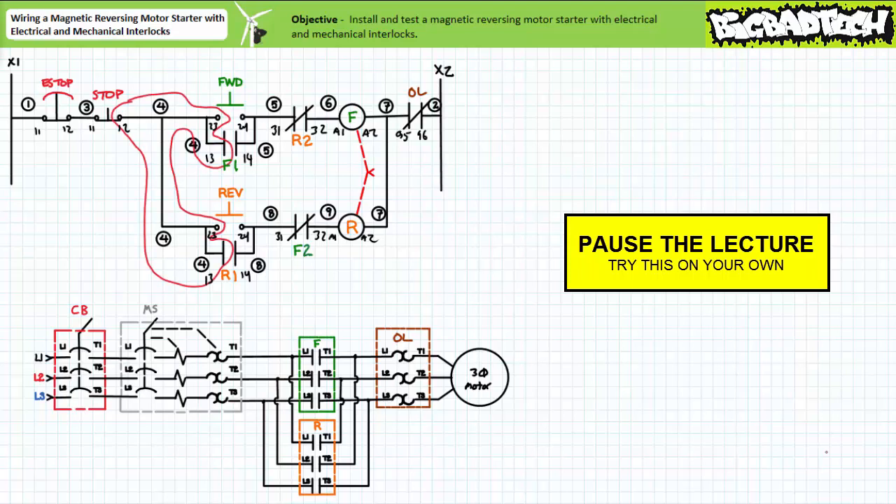Quick hint: wire numbers are best thought of as nodes. Wires four, five, seven, and eight are all pooled connections, and only convenience dictates which terminal is physically employed. You cannot make this decision until you're actually physically wiring up the real circuit. Additionally, note that part of wire seven — the pooled connection of both contactor coils' A2 terminals — has already been made by the handy set of pre-configured reversing wires.